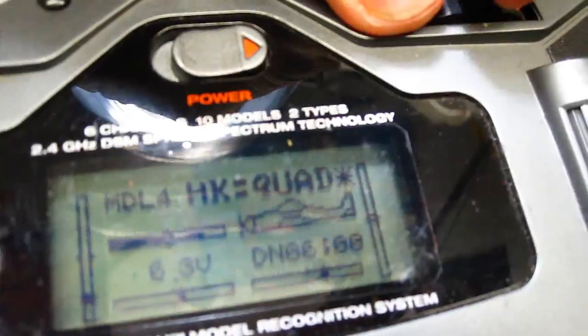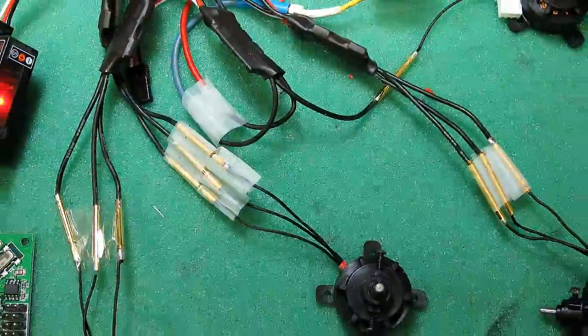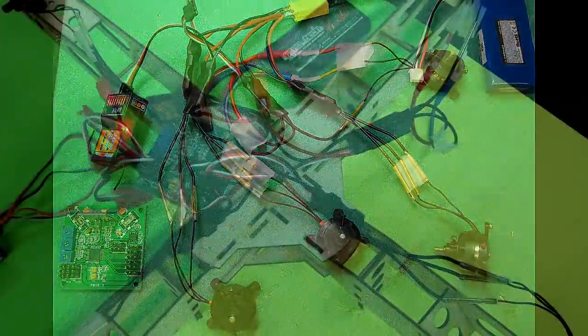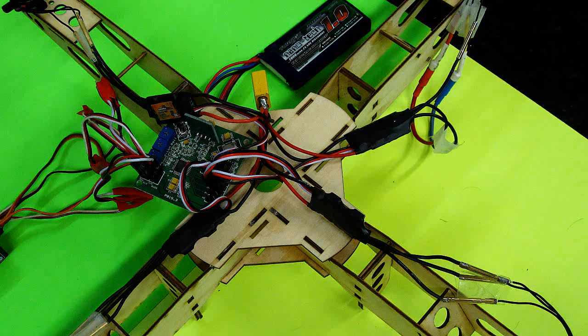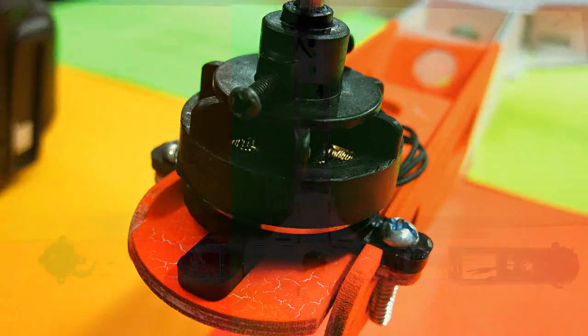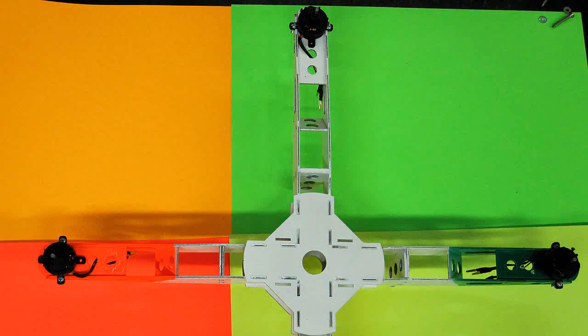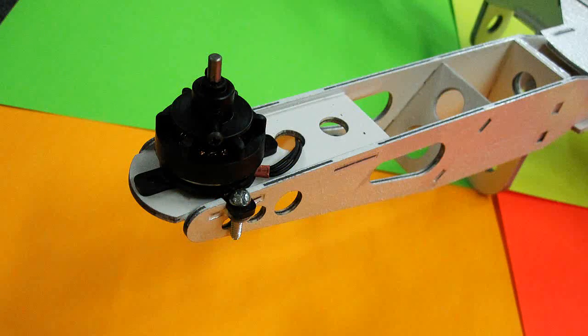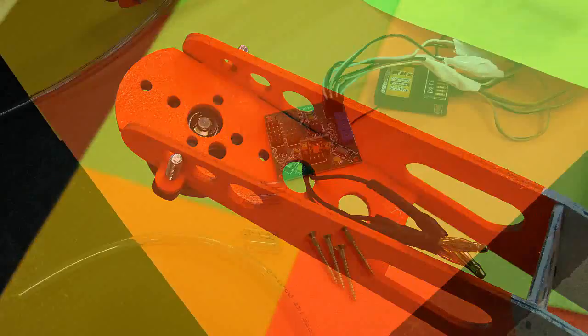In my next video I'm going to show you what I had to do to fix the DX-6i aileron trim issue, so if it ever happens to you, you'll know how to fix it too. Something really important: you're going to need to lay everything out first and hook it up, as the wires to the motors just barely fit the frame. It's important to know how to solder and have a nice soldering station. Please be careful during setup — tie it down, because if something's not right, it can easily flip over with only one motor. So be safe.